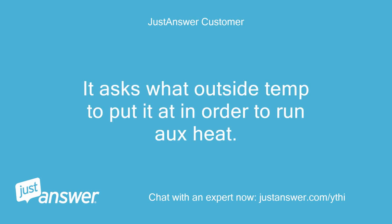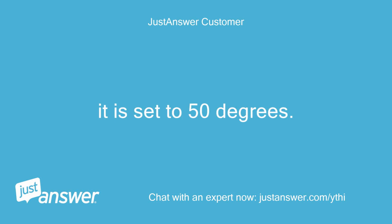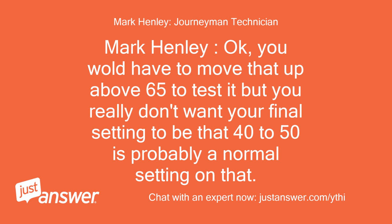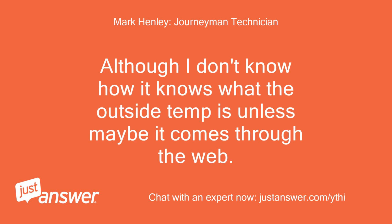It asks what outside temp to put it at in order to run heat. It is set to 50 degrees. Right now it's about 65 outside. Mark Henley, okay, you will have to move that up above 65 to test it, but you really don't want your final setting to be that. 40 to 50 is probably a normal setting on that. Although I don't know how it knows what the outside temp is unless maybe it comes through the web.